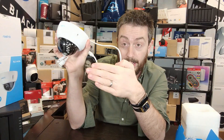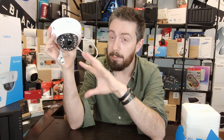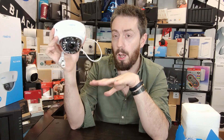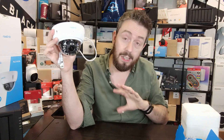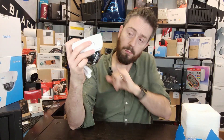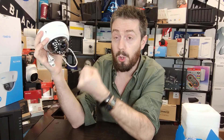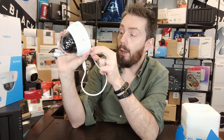The five times optical zoom also helps with tracking and capturing facial detail of people passing by. The camera supports the H.265 codec, a much better compression technique, giving you about 150 to 160 hours of full-resolution recorded footage on a 256 GB card. It also has recycling built into both the NAS software and Reolink's own software. There's a microphone for audio recording, so you'll capture any audio from people passing by, though there's no speaker — no audio out.